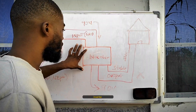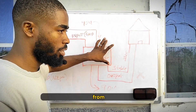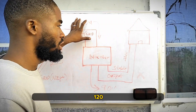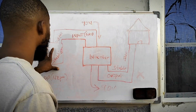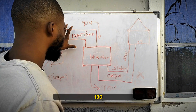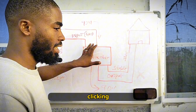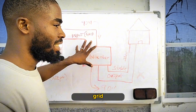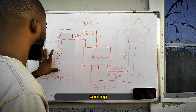At times some inverters will not even switch to grid — they will not bypass this voltage and will still be consuming from the battery. Some inverters switch over only when the voltage is around 120 or 150 volts. That is when they switch and start working. And that is why you need a stabilizer, because if the grid keeps fluctuating between 130 and 150 volts, you'll keep hearing the relay clicking, trying to bypass between the inverter output and the grid output. So you need the stabilizer to stabilize whatever is coming from the grid.